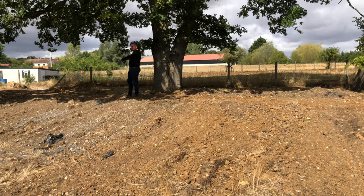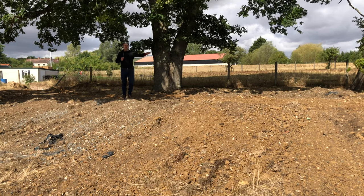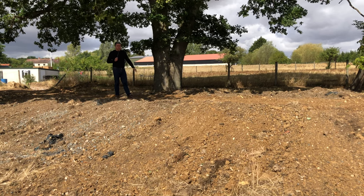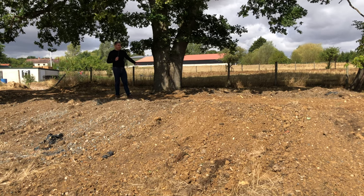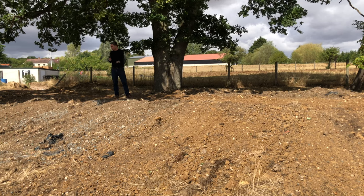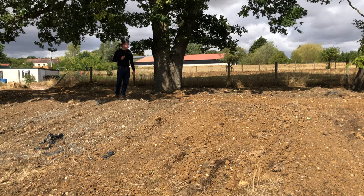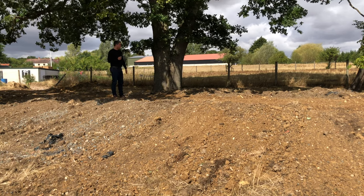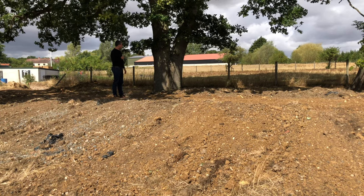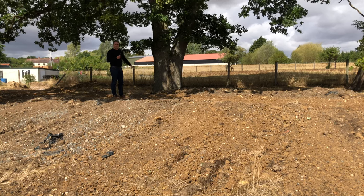From here you can see the track coming through. Up on the embankment we're going to build this up with a load of aggregate and get a very firm base, because the last thing we want is any landslides. We've graded out the earth, and we'll get that fully seeded so plants and grass will grow through it and make it much firmer. On the other side we've put a drainage channel in to protect against water coming down the hill.